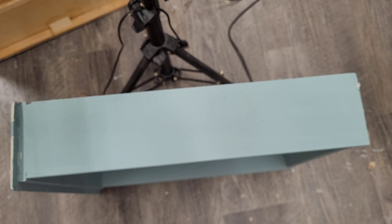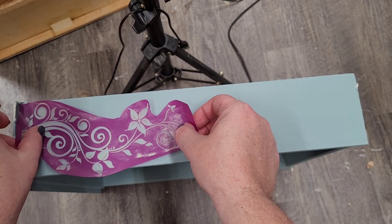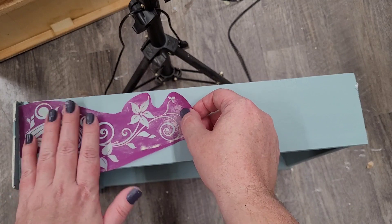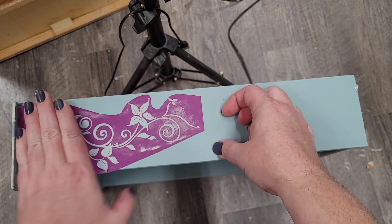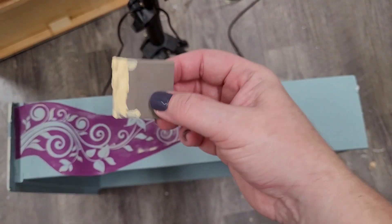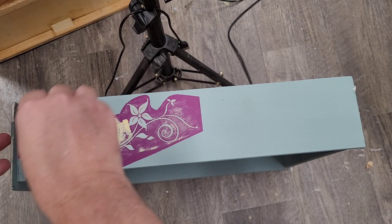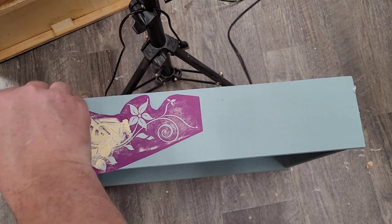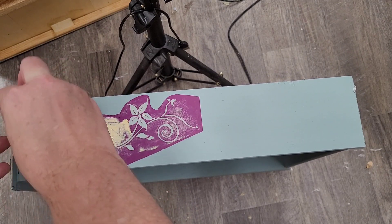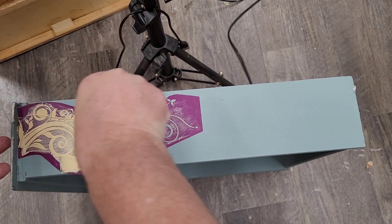This little floral vine is perfect for these drawer sides that I'm going to be putting on my piece. I start out by cutting out the design that I want to use to isolate it from the rest of my silk screen stencil. The silk screens are lightly adhesive, so I just press it down onto my piece, and then I'm going to take my Dixie Bell Paint — this color is called Rebel Yellow — and scrape it over the top of the silk screen stencil using a silicone spatula tool.